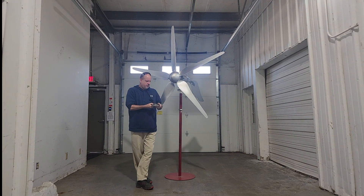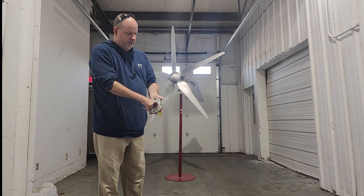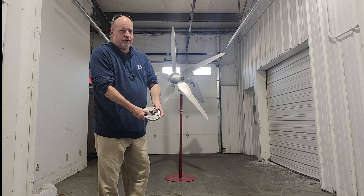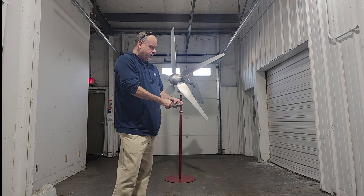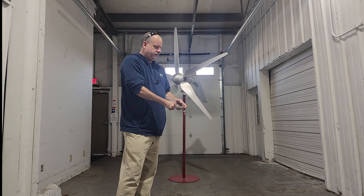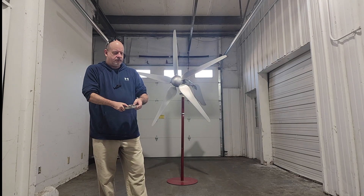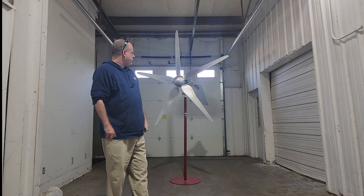What comes in this kit: we have a flange coupling that needs to be welded to a pipe — preferably at a minimum two inches diameter. This is a relatively heavy turbine, so, depending on your height, how high you're putting this up, we'd like to see this on a thicker-wall two-inch pipe.